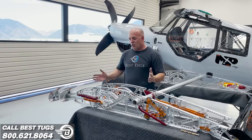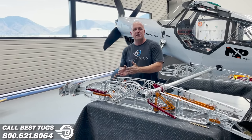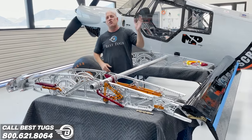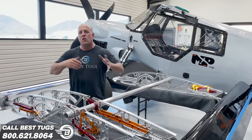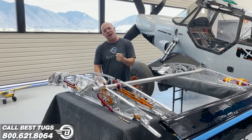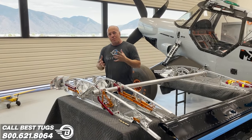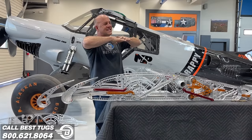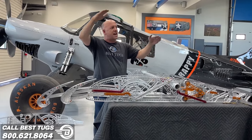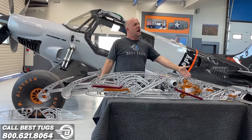So ultimately, I took a Cub, tried to pair up where its movement would be on a small, single, standard flap, no drooping ailerons, no double slots, no larger wing, where when you slow down, you slightly need a little more aft elevator, just a little bit, so it feels and flies like normal, but I've actually grown 16 inches in camber arc line. The length of the camber line has grown a full 16 inches all the way across the entire wing, ailerons and all.